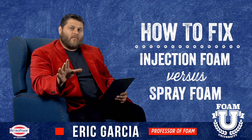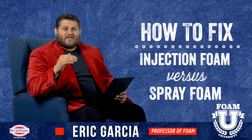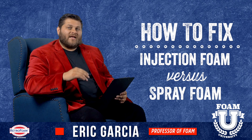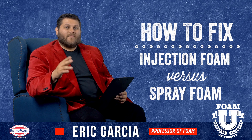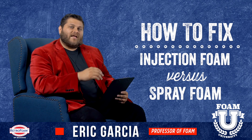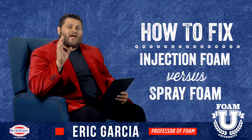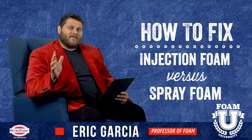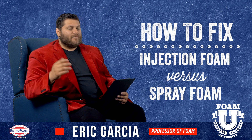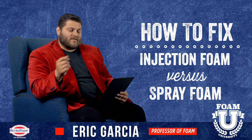However, the safer bet we would recommend is spray foam. It's usually best to cut an access opening on the underside, depending on accessibility, or on the front face of the cantilever and spray foam in there. Make sure it's sealed off all the way around so no air gets into the living space or the floor. If that cantilever goes all the way through your floor, it can make your floors cold and could be contributing to that problem.